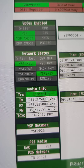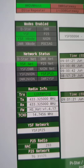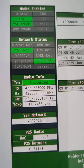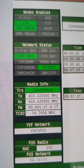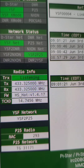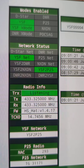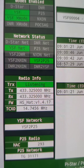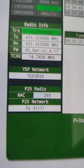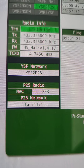If they're not green — if they're yellow, orange, or anything else — then there's something wrong with your configuration. If they're both green, that means both modes are operational. In the network status, you should also have YSF net highlighted in green as well as YSF to P25 highlighted in green. If you've got all green across the board, you're good to go and ready to roll. And further down in the admin page, you'll see your YSF network is YSF to P25.